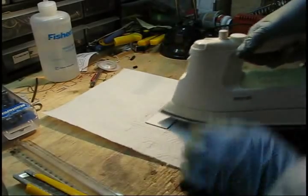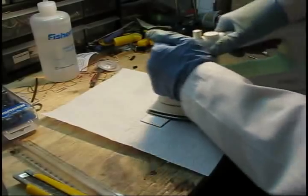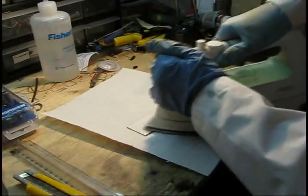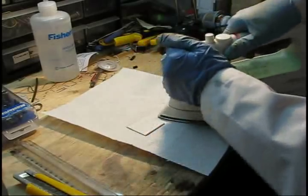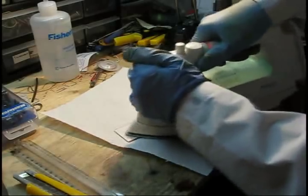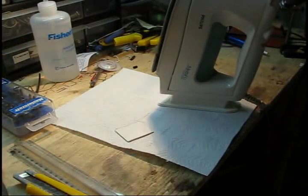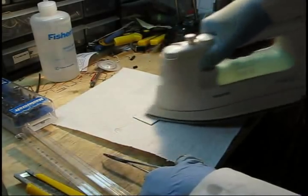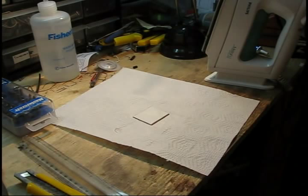You want to keep rubbing on it. What I also like to do is use the corner of the iron and put some real weight down onto it, transferring lots of heat and pressure onto the paper. Since it's Staples brand photo paper, it's actually pretty thick and will handle a lot of abuse. Regardless, you want to make sure that during this step you get all the toner transferred on. You'll also notice that your work has a slight tendency to slide around, so just have something handy like a pair of hemostats to move the workpiece around. Once you're satisfied with the amount of pressure and effort you've put in, you can unplug your iron and dunk this into water.